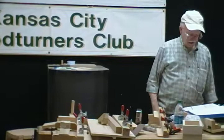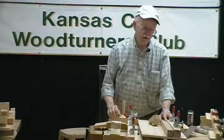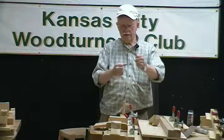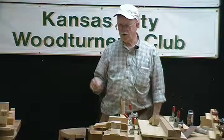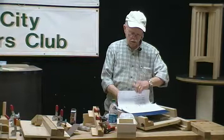That was the Andre's pin jig. Has anyone ever seen Gary Milkey make the trophy flags for all-star trophies? I'm going to skip that in view of time, but Gary does an operation called pattern sawing. You take the shape of the trophy flag — it's got steel pins in it — lay it down on the blank, put an auxiliary fence on the table saw, and you can make that trapezoidal cut on the table saw without any positioning at all. You just pull the pattern.